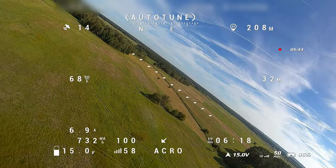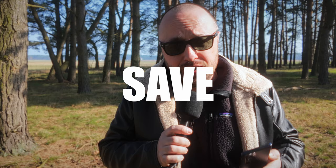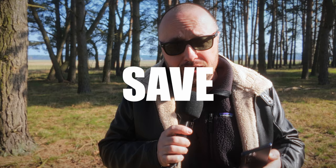How long should you fly like that? It really depends — usually it takes a minute or two, maybe three. But at one point you will notice that the behavior of the airplane is no longer changing. This is the moment when you should disable the auto tune mode, land, disarm, and manually save the new PIDs and rates. You can do it in the OSD, with stick commands, or after connecting to iNAV Configurator. Remember: if you power cycle the flight controller without manually saving the new tune, your tune will be lost.